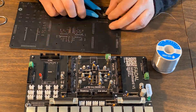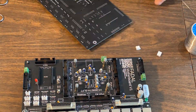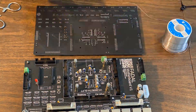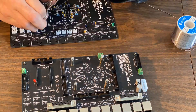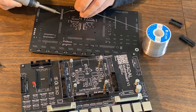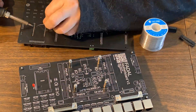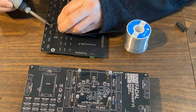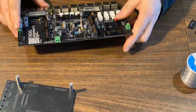Having an extra PCB as a tray for your parts is very nice. It's super efficient. You can do all the prep ahead of time — when you start soldering, you have all the parts in and they're already in the right position, right orientation. So there are less chances of making a mistake.